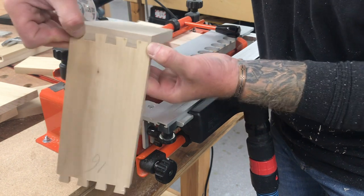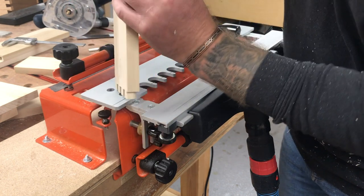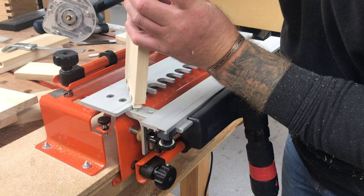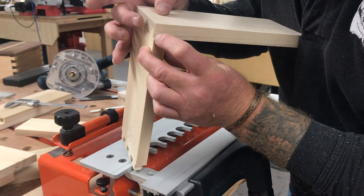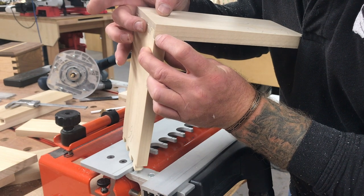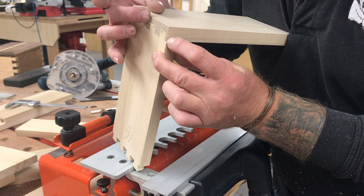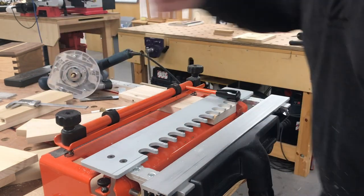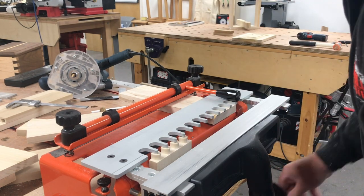One thing we have got is a little bit of overhang that way. To be honest, we want the overhang the other way. So this board, a horizontal board, is overhanging the vertical board just a little bit, just so we can sand this back to this, because sanding this back to this, or planing, is really difficult. And that's easily controlled. What we need to do is just pop that in.